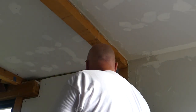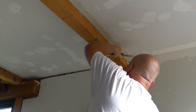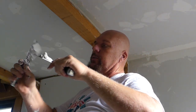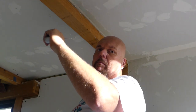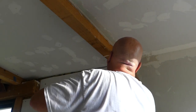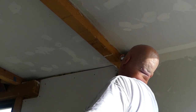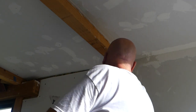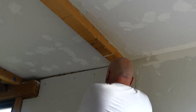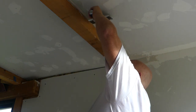And oh look, the sun's coming out. And then make sure there's no crusties. And I mentioned that before. I didn't show you I did it, but I did. Wherever it is, I kind of favor that side of the trowel, so I'll do that side. And as you scrape the mud, you change the angle so it comes out smooth. It's hard to see the angle, but that's how the professional guys do it when they scrape. They're flattening the trowel while they scrape, and that's how it gets super smooth.